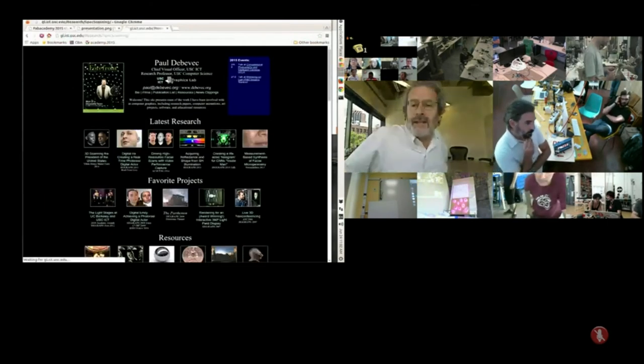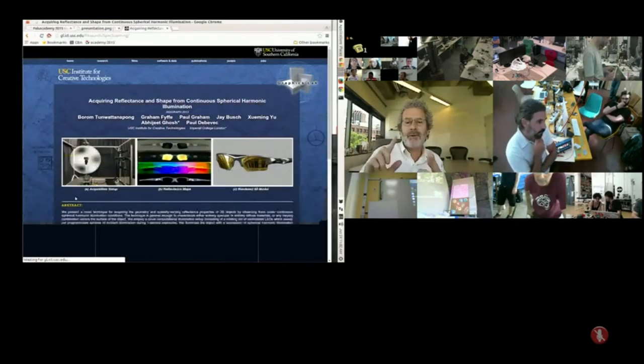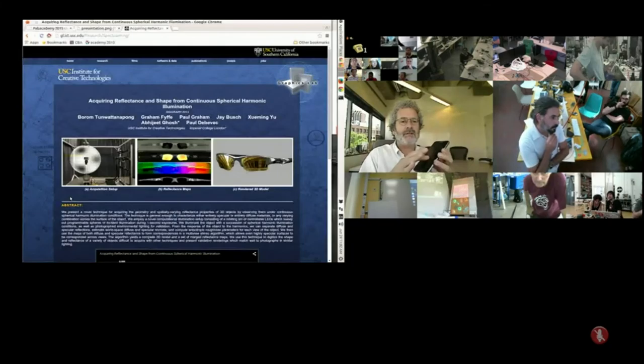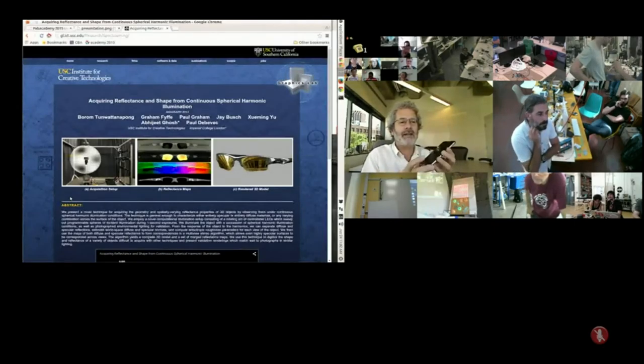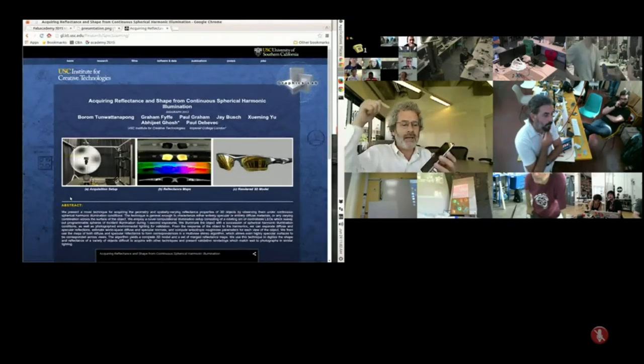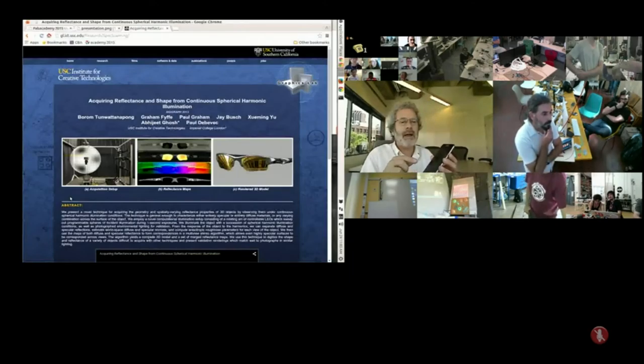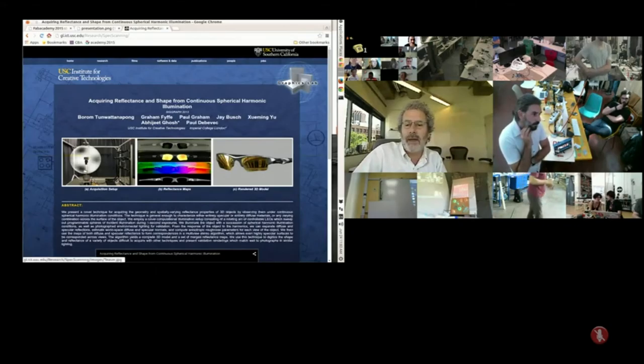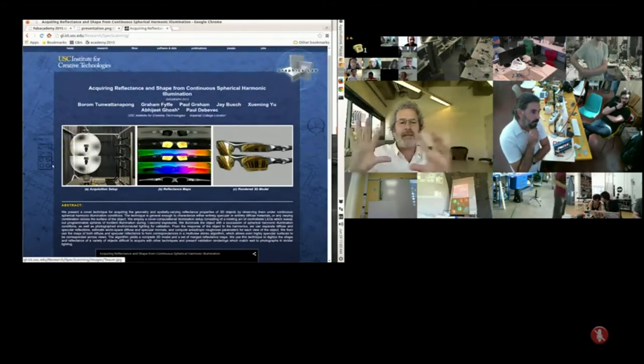Okay, let's take a first pass. One suggestion is, let's see, this is Paul Debevec, who makes light stages. If you can separately control the illumination, orientation, and detection, what you can do is, for example, for a shiny surface, separate specular and diffuse. For photogrammetry, it's hard to measure shiny things, but if you can separately move the camera and the light, you can separate shiny scattering, specular, from diffuse scattering that's matte.